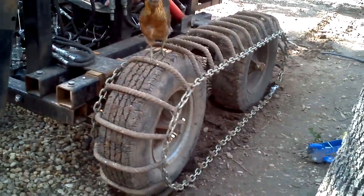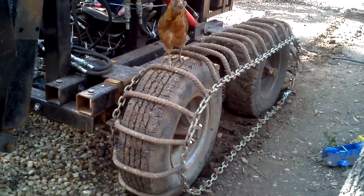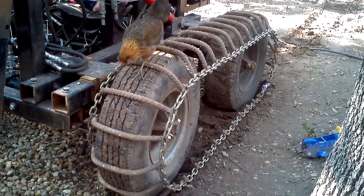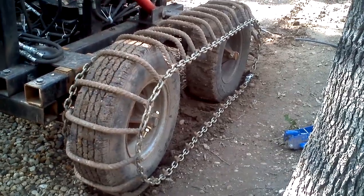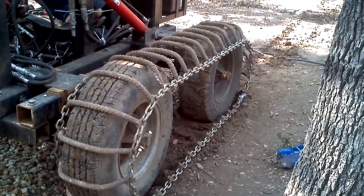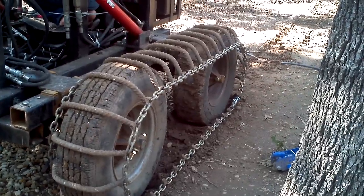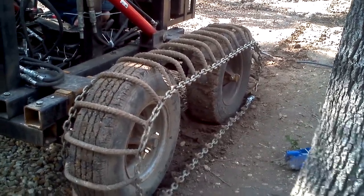The new Quick Attach wheels are working good so far — haven't noticed any issues. We did have our tracks too loose, so we've tightened those up significantly. We did this by removing probably at least eight links or so, deflating the tires, putting it back on. We used a come-along to tighten it up and then put the master links back in. Now you can see that they are quite tight.